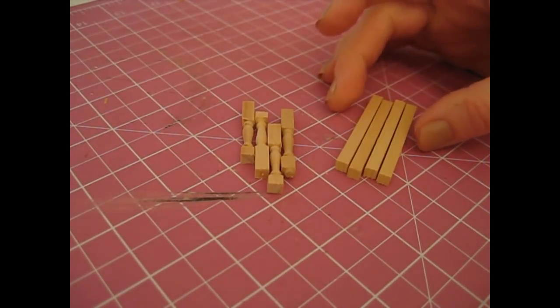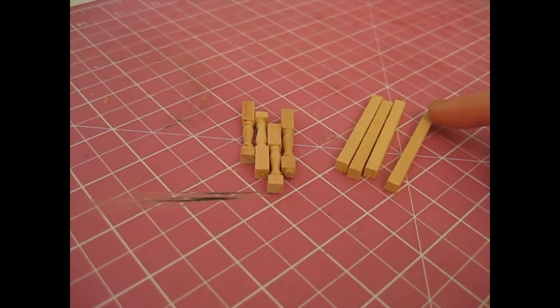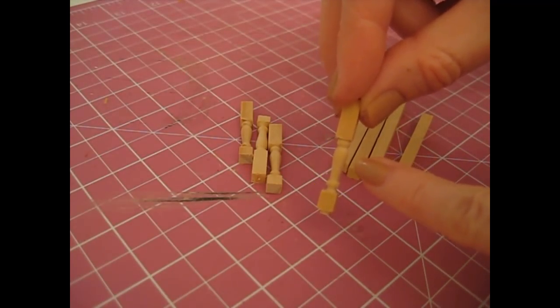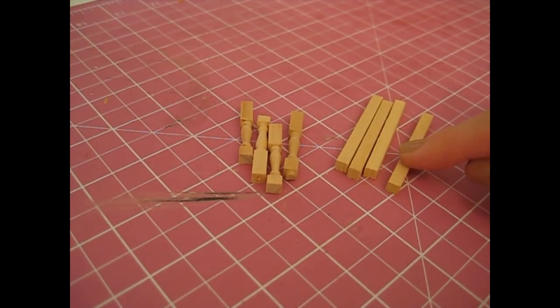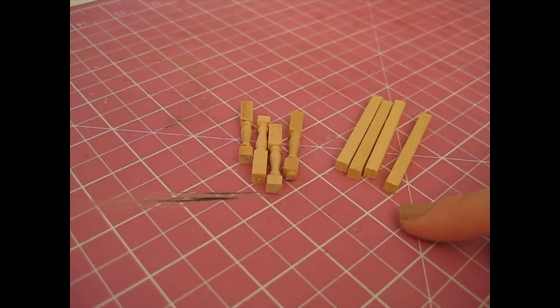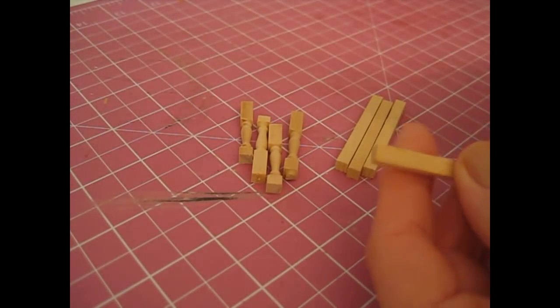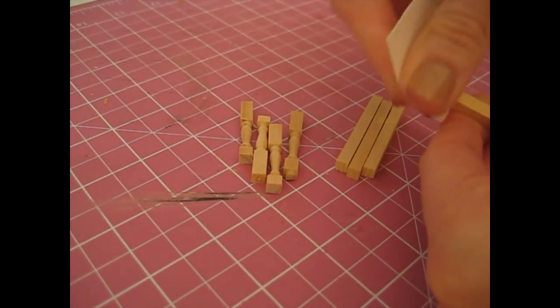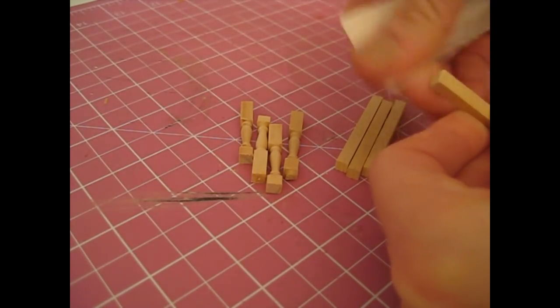We're going to begin by preparing the leg pieces. In the cutting list I've given two sizes for the 5x5 strip wood, because you can either do the leg as I have done it — a straight leg going into a shaped part cut from a spindle — or you can have a full straight leg and attach the casters directly to the bottom of the strip. Whether you're having a shorter or longer leg, take a piece of fine grade sandpaper and gently round over one end of each leg, which will become the bottom.